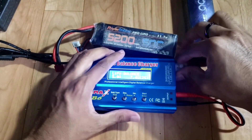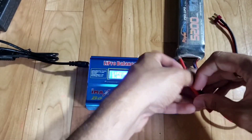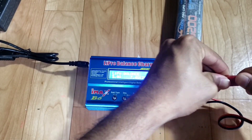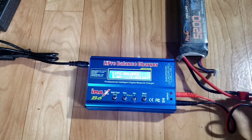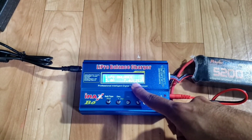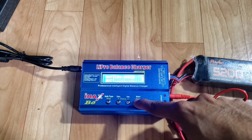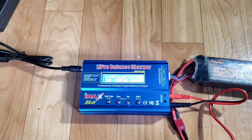When you finish charging, the charger will beep letting you know the battery is full — just hit Stop and then unplug the lead first and then the balancer. Now let's check the 3S. My friend has an EMAX so he can run either 4S using two 2S batteries or 6S using two 3S batteries. For 3S you plug into the connector right next to the 2S connector, and then do the same steps except change the setting from 2S to 3S and long press to confirm.